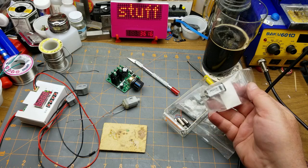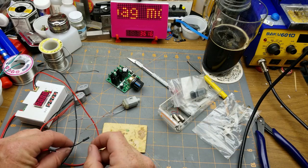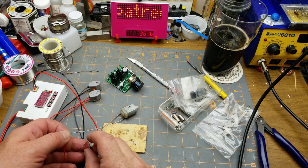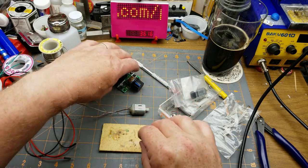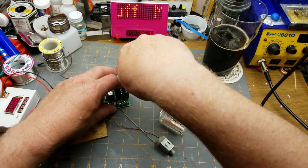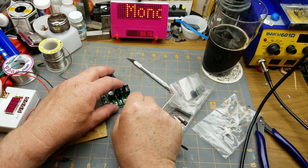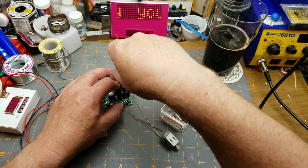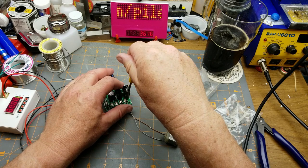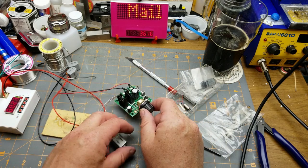I'm a little short on 12V motors — the closest I've got are little toy motors from Princess Auto for use in locomotives. I've set my power supply to about 14 volts, which in short bursts shouldn't be an issue. I'll tie the motor onto the output of this controller. One thing I notice is this is not a reversing controller — it's unidirectional. That's okay; I may not even use it for motors since you can probably use it to PWM anything.